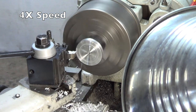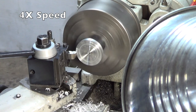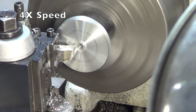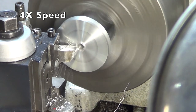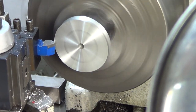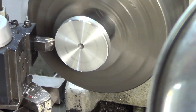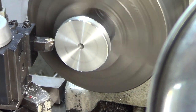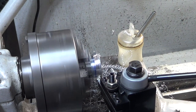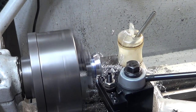I've now reversed the part onto the other side, so I'm going to quickly face it and then start carving the features required on that side. Let's chamfer the edge - that's the bottom part - and then let's start doing a 25-degree chamfer for what will appear to be the top portion of the base. You can have a better look at the actual 25-degree angle, and it's going to give me one-eighth of an inch rim at the top.